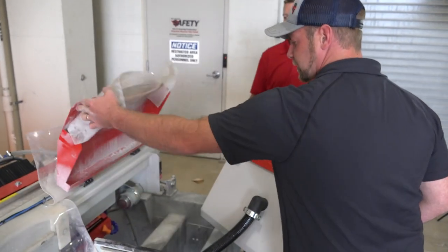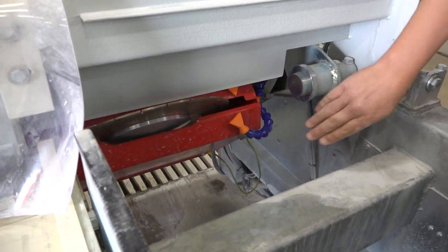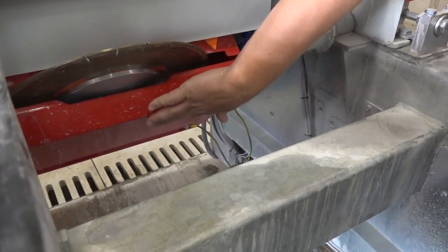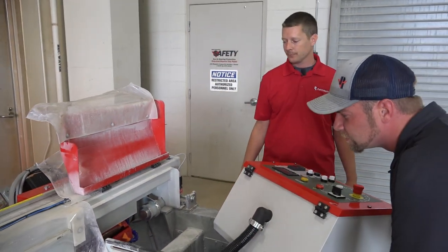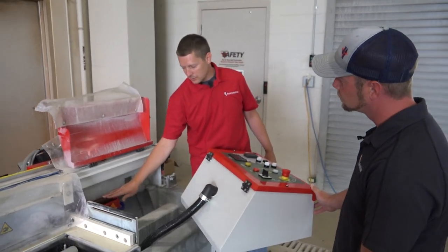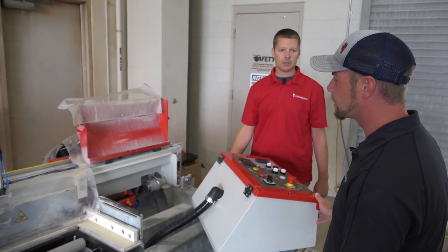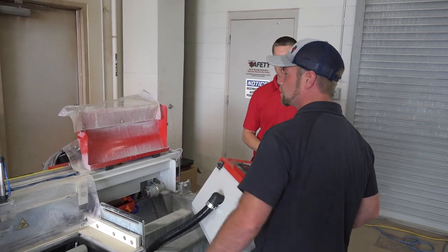The machine ships with a 14-inch diameter blade. It mounts easily — a simple shield to pull loose, then pull your arbor nut loose to change blades. Why is a VFD important? The VFD is very important because we can run different types of blades to cut different types of materials — porcelain, Dekton, granite, quartz. We need that capability to adjust RPM to accommodate those materials.